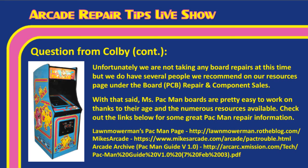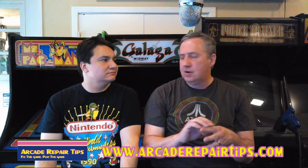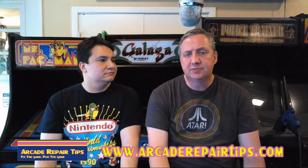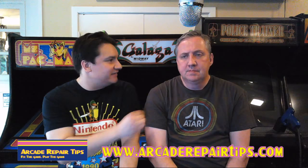And I should mention that we fix a lot of boards by just simply cleaning the chips. A lot of them get kind of corroded and stuff. You can find out which chip is your problem. Sometimes taking that out and cleaning it up really good, the legs get oxidized and stuff, and putting it back in there, sometimes you can fix your own board without any parts just by cleaning it really good. Right, and socketed chips a lot of times like to come out of socket, and so pressing down on chips, making sure that everything's making good connections, checking the legs, Tim, to make sure there's no cuts in a leg or something like that, or disconnections. And of course, Tim, double-checking your solder joints, making sure everything's soldered properly.